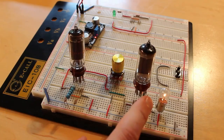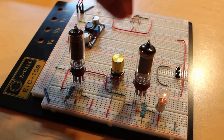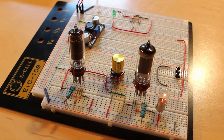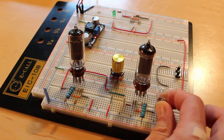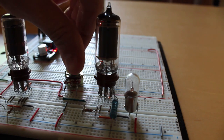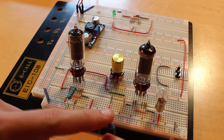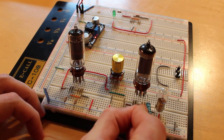This is a 6-volt bulb, so we have our 100-ohm resistor and the 8-volt drop to keep from blowing it up. Now let's see if we can turn it off. Rotating the knob doesn't do anything — that's because the gas is ionized, and the only way to break that ionization is to cut the current flow. I can pull the bulb out, put it back in, and that cuts the current. Maybe we'll run two resistors in parallel to split the power and keep them from getting so hot, which should also drop the resistance a bit and give us a brighter bulb.